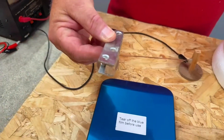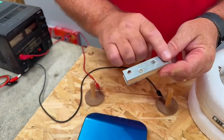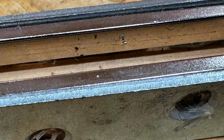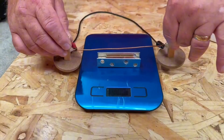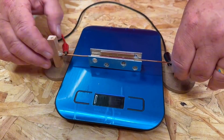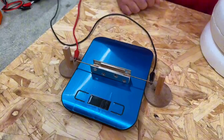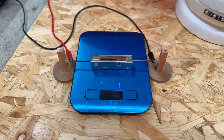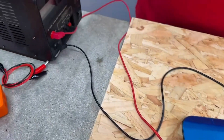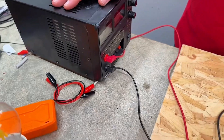Quite simple - we've got just a piece of timber and a flat bracket from B&Q. I've also got two magnets inside there, two really strong neodymium magnets. I've placed a conductor here within that magnetic field. It's going to be a dead short so we need to control the current - my power pack has a current limiter on it, so it'll only allow approximately two and a half amperes.